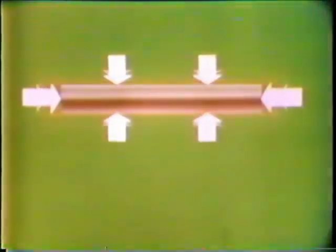But first of all, we must understand what causes distortion. Let's start with this ordinary steel bar. If the bar is heated thoroughly and uniformly throughout its entire volume, considerable expansion in all directions will take place. Now, if the bar is allowed to cool evenly, without restraint of any kind, we know that it will contract to its original shape and size without distortion.